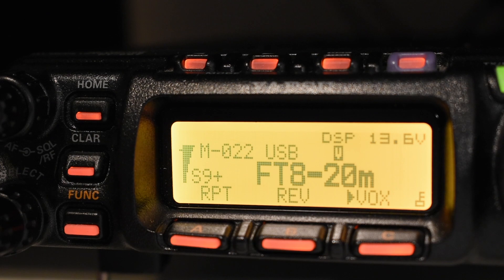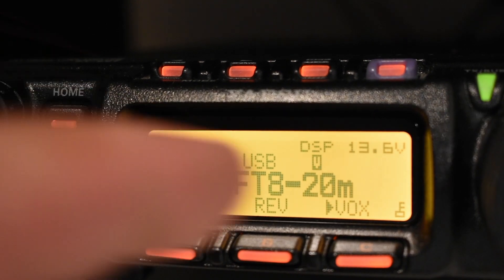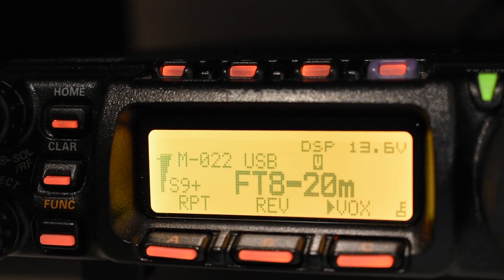The mic connections on the actual lead going in is pin four and five on the RJ45. You can also plug your mic in if you've got a freeway connector for the RJ45, so you can set up your standing wave ratio and tune your antenna at the same time, or briefly transmit off-channel on low wattage on AM or CW just to check you're transmitting alright. That's the menu settings really, and like I say I've programmed the FT8 frequencies into one of my memories.